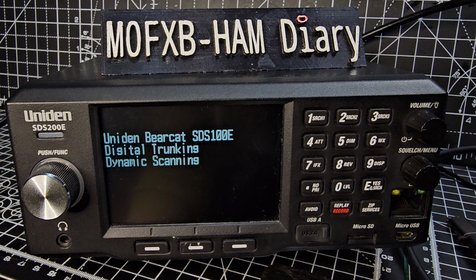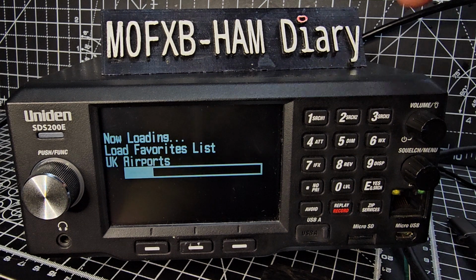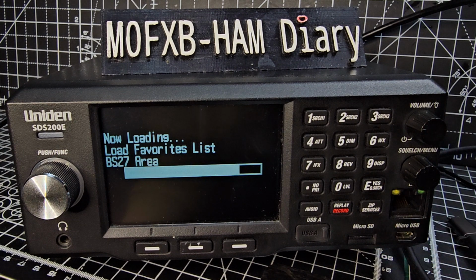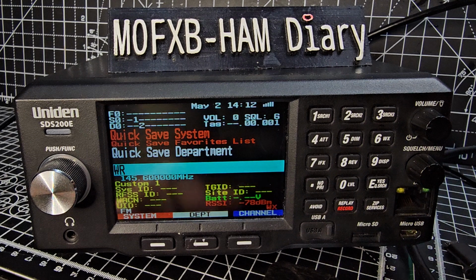When you press the no button, software that will display your screen on the PC will use a COM port that is enabled when you connect a lead to this connector without pressing the yes. You can also program using Ethernet. You just tell the software to use the IP address. This is a bit of a dummy connector.